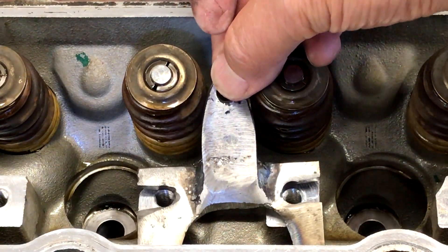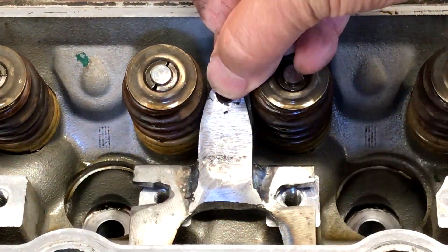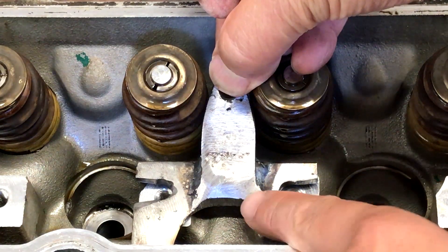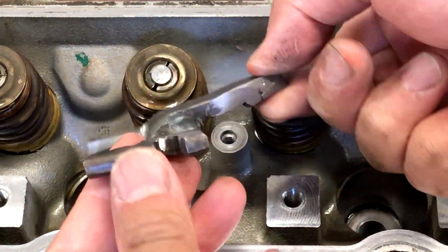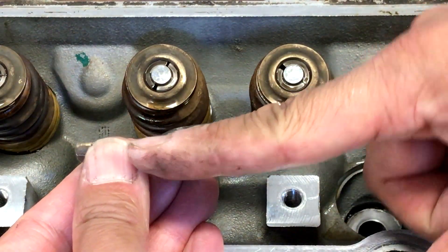If I had a video to watch it would have been a lot prettier. Basically, get your flat bar stock, cut it, and then you're going to weld on another piece which comes up this way. The other key measurement here is it's approximately 14 degrees difference from here to here.